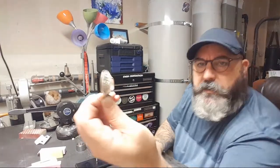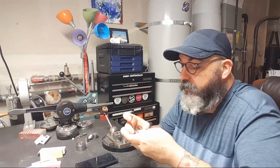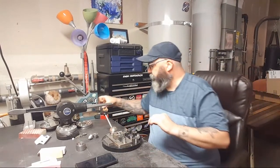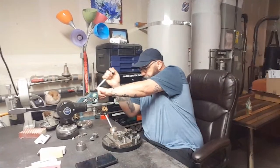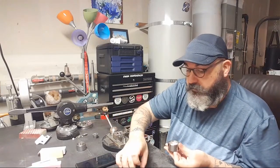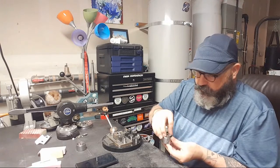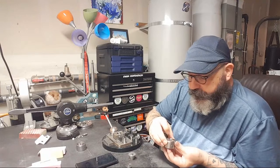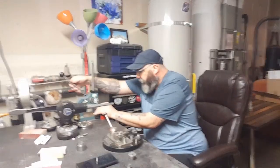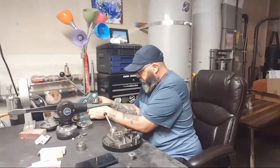So that's after just one press with the one cone. And I'm going to switch sides of the die here because it fits higher on the die this way, gives me more room to work. I'll go to the next size cone. Just continue until that is folded. We call this process folding. Oops, looked like we skipped one. Went right to this one. I'm going to actually go a little further with this one. Give me a little more room to work with here if I can fit this in there. Looks like I might not be able to fit it. There we go.